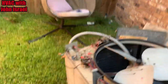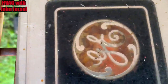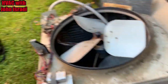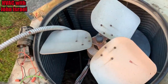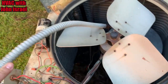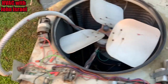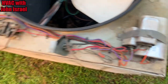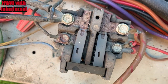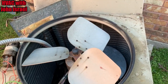We are removing what I believe is a 1983 GE. My buddy Ted Cook is looking up the serial number for me right now, we'll wait for his confirmation. This compressor is shorted to ground, with a BX whip that we took off the disconnect. We'll put a liquid tight whip going back with a Weather King. It's another budget job, but you can see they don't build them like this anymore — three capacitors. That's the original contactor, original fan motor, original fan blade. Everything on here is original. I believe it's from '83.